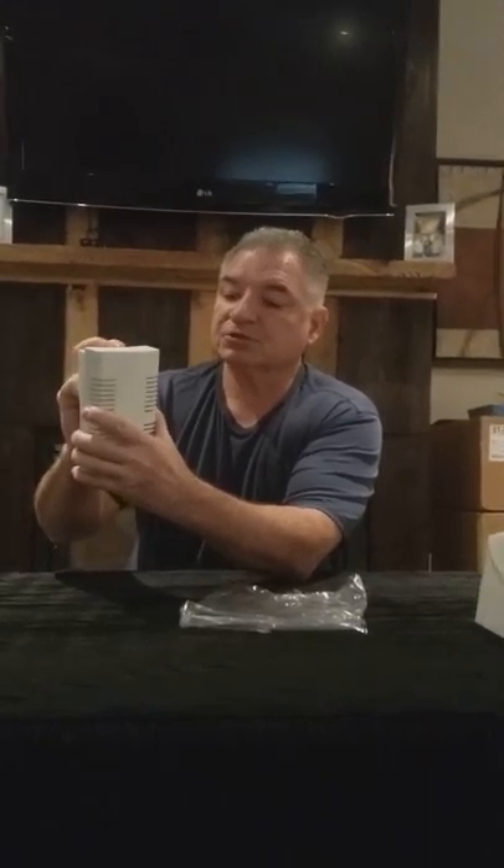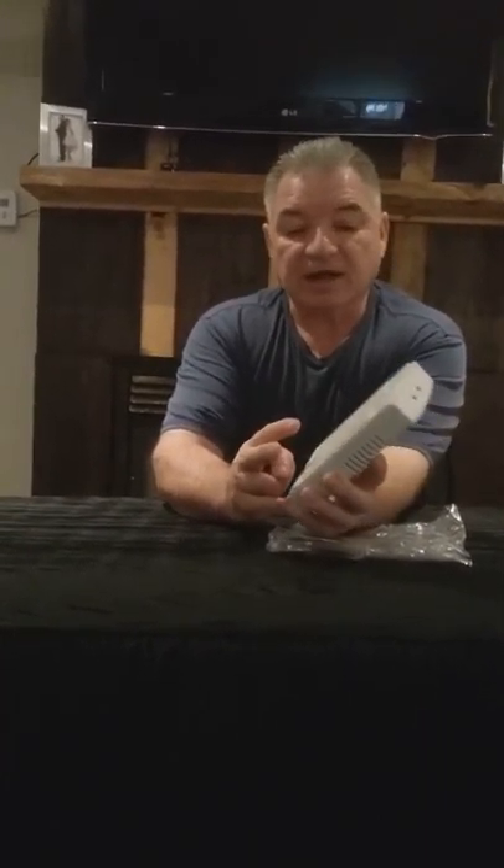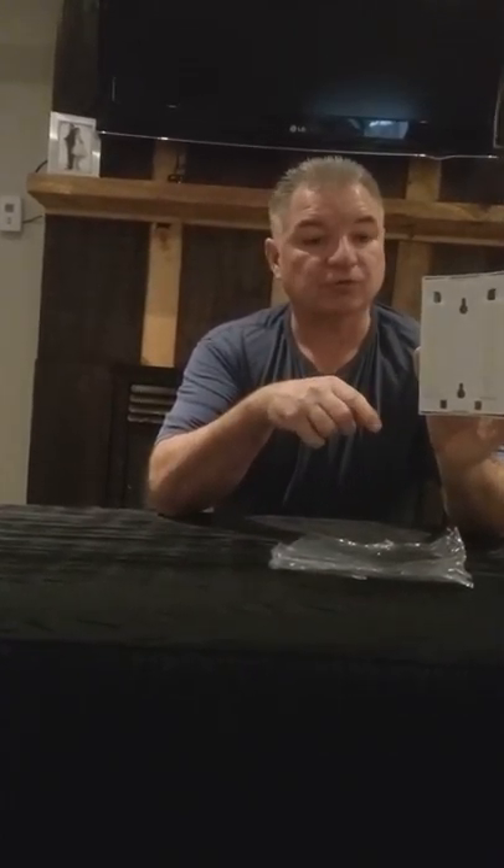So that's pretty well it. We're going to close it up — just line up the bottom like such, and pop it in on the bottom. Push the two prongs down, snap it closed, and then you can mount it. The unit comes with two-way tape on the back, or you can use a screw to slide it on using the two prongs.